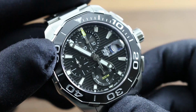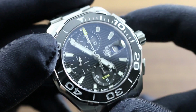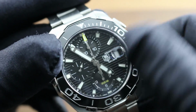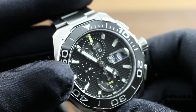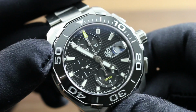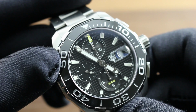This starts by recognizing that although the watch is automatic winding, it can be manually wound by threading the crown out to the first position and then turning it in clockwise fashion 30 to 40 times until the watch can be seen ticking. You'll note the advance of the constant seconds hand at 9 o'clock. At this point, this automatic winding watch can energize itself in the natural course of action on the wrist thanks to the internal automatic winding rotor.